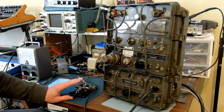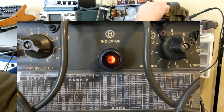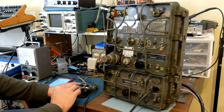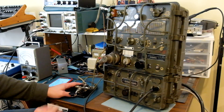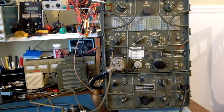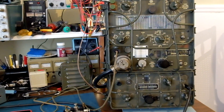Now we're going to tune it. When we tune it, we have to choose the right antenna selector and then adjust the antenna capacitor until we get the most brilliant glow from the tuning indicator neon bulb. A 1950s military radio with a built-in antenna tuner — how cool is that? Let's change the antenna. Here we go.